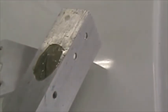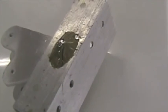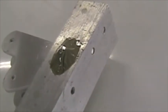Thoroughly roughen the aluminium bracket where it's going to bond, and also roughen the recess on the inside of the wing. Mix up some cotton flocks and put this in place with the pop rivets. There the bracket is bonded and pop riveted in place. You can see on the lower surface there I've drilled a number of 2mm holes to allow the cotton flocks to squeeze through and improve adhesion.